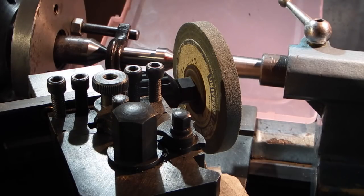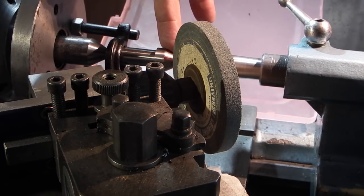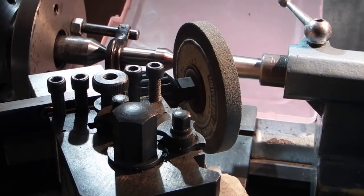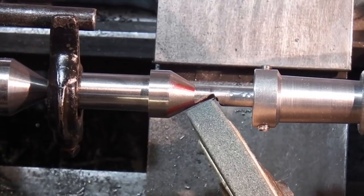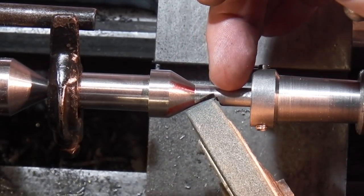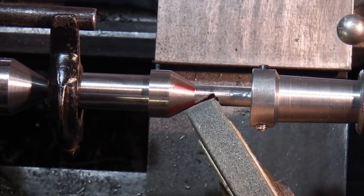But if you're doing multiple centres - if you've got four or five centres you want to grind - this is an easy way of doing it because you can just take them out and put the one you want to grind in. The only other way of doing it would be holding it in a collet or a chuck and clocking it up to make sure it's running true. This way I'm coming off the centres. As I wind the tail stock in, this is spring loaded so as you grind off the face of the centre it will automatically adjust. You can go right up to the point.